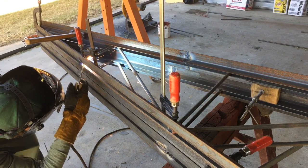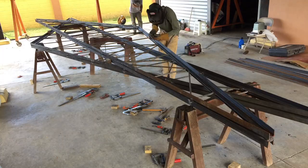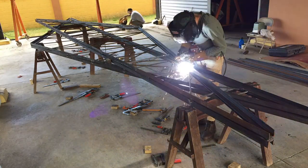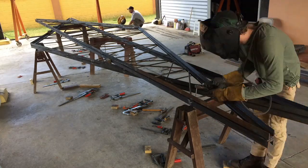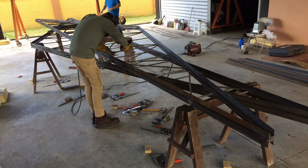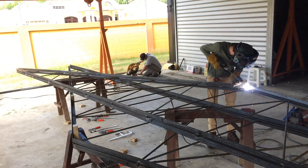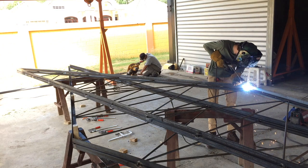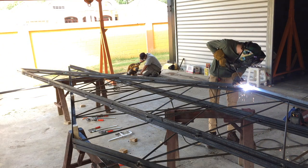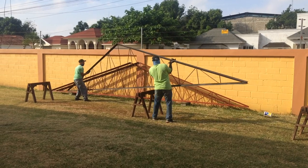so that I can weld the other side of them more conveniently. So how the trusses are fixed to the wall is in the header beam where it has the rebar cage tying all the columns and blocks together. I utilize some quarter inch plate and use half inch round bars bent into some hooks, and those are embedded into the concrete. I have another video on my channel where I make the roof anchors, the truss anchors, so you can check that out if you're interested.